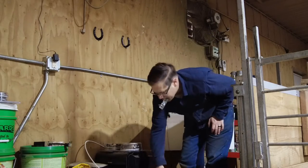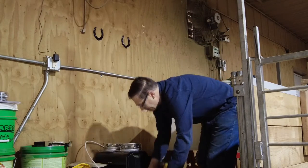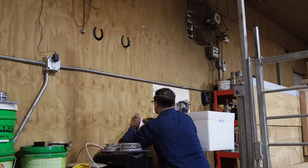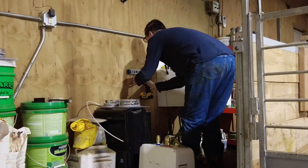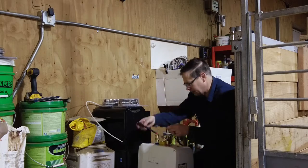Here I'm fitting it on the wall. I found a couple of studs, so I know exactly where they are. I'm going to put the little plate on — it's got two adjustable screw holes and two solid screw holes. Since I've got it in the studs, I'm going right into the two solid holes. Once I've got it screwed in level, it's just a matter of hanging the unit at that point.